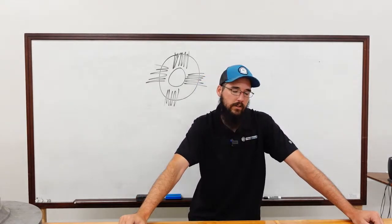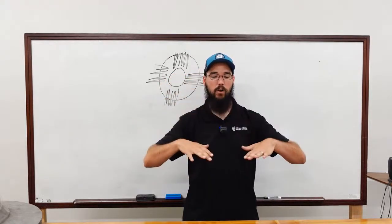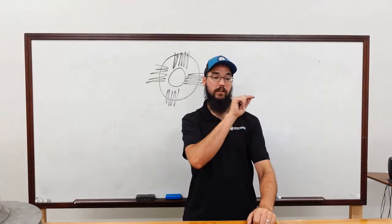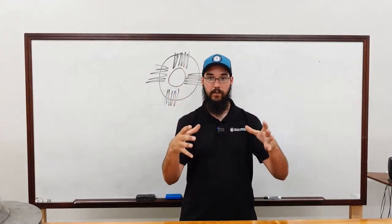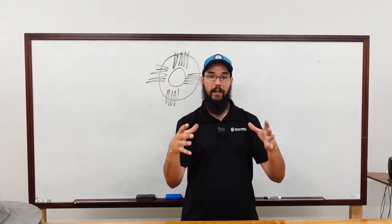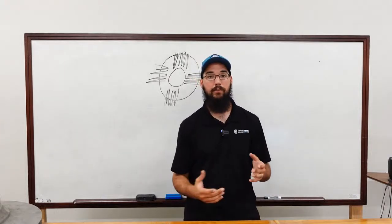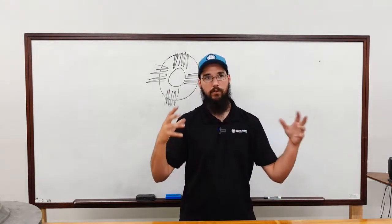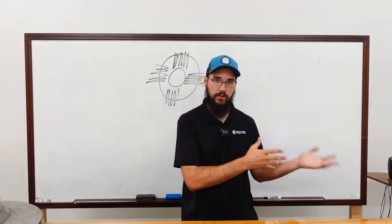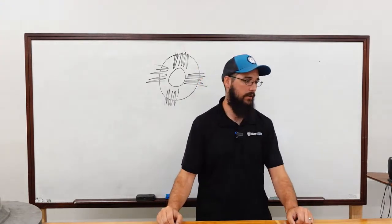what I use is the condensate line. The liquid refrigerant there will condensate real heavily, and there'll be a literal clear, distinct line on the housing of the flash tank that is indicating your actual level. So that's what I heavily use and base it off of. I see where that condensate line is, and then I can compare that, within reason, to what the sensor says I'm at. As long as I'm on the same football field, I'm usually pretty okay with it.